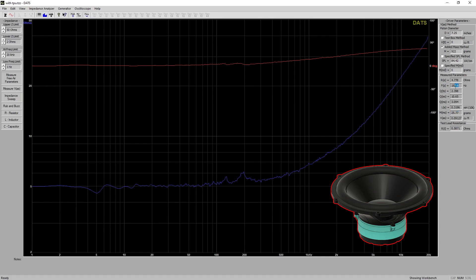I need to see about lowering the FS down to a sub-100 Hz range for it to be considered a true subwoofer. That's the goal moving forward — to drop the FS down to an acceptable level for a subwoofer while maintaining an SPL of preferably over the 81-82 dB range for 1 watt at 1 meter. That's the end goal of this subwoofer.